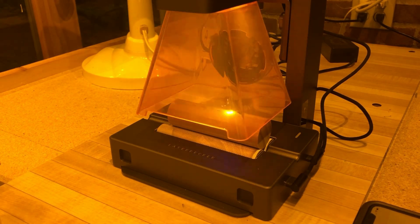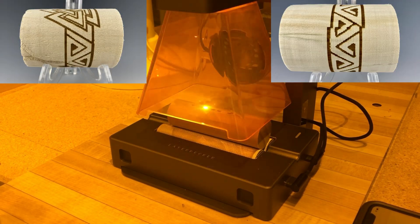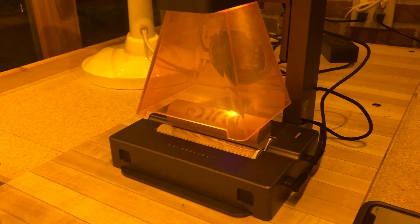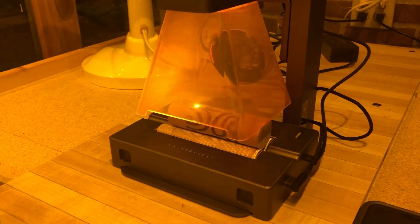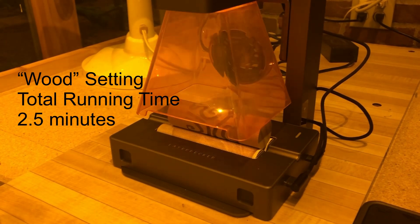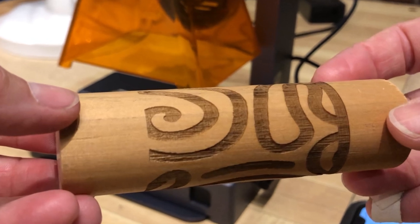One of the things I really wanted to try was to see if you could make a design go all the way around a cylinder — and you absolutely can. I just did a quick spindle turning to have something to play with, and it's not even, which is why my design didn't line up. The one that is on the unit right now is a dowel, so it is round. You'll see that you actually can make a design that goes all the way around and lines up if you have the length correct. I used one of those flexible tape measures you use in sewing to get the circumference of the dowel, and then I burned that as the length and it lined up. I was pretty impressed with that.